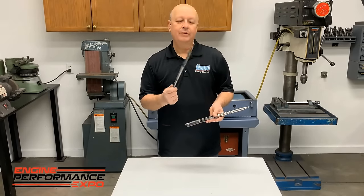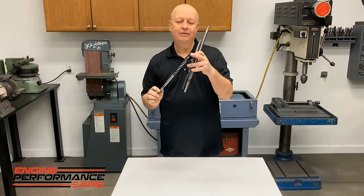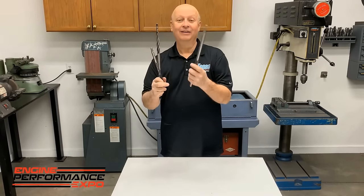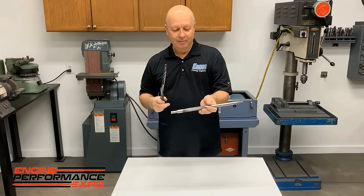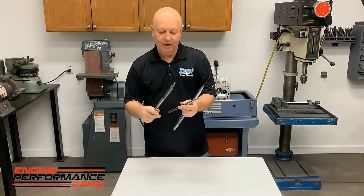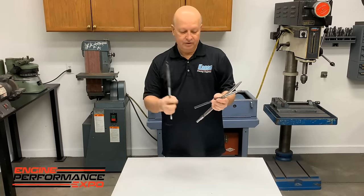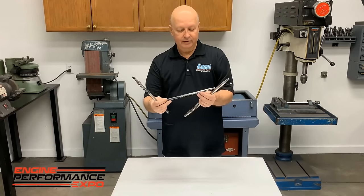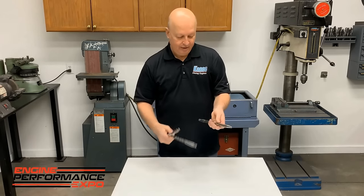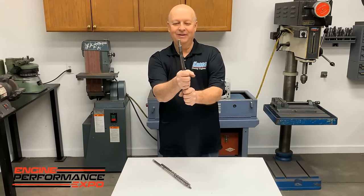So these are different kinds of reamers that we made. They center on the lifter, that's the push rod end. This is the push rod end, this is the whole push rod. You know, this is for a big engine, big push rod. But you just figure out a way to graft a reamer on it. These were actually core drills that we grafted onto them and then put some extensions. This is a core drill, it's welded to a push rod. It's probably even not perfectly straight. And then this was a reamer. You can see right here, that's a 5/8 reamer.